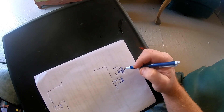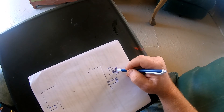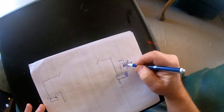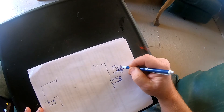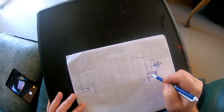If your battery's at full charge, this thing is likely going to be energized very little. And if your battery's having a big load on it, it's likely that this thing's going to be putting a lot more juice into the field current, increasing the magnetic field. So that's what we're going to do here — we're just going to control the field current.